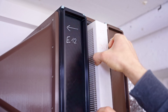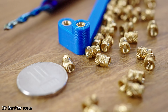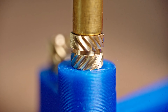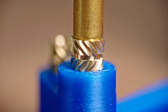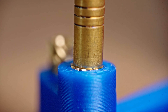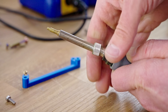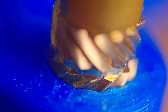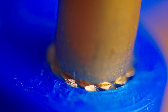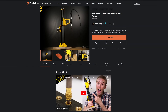A metal-on-metal connection is hard to beat for durability. Heat set inserts are easy to design for — you just need a plain hole — but this time the tolerances are much more forgiving, as you're melting the entire thing anyway. But for setting them straight and accurately, you need a good amount of patience, a soldering iron ideally with the proper setting tips, and some people even build little linear-axis guides to keep their soldering iron straight, so overall it's quite a bit of post-processing time you have to spend on every single threaded hole.